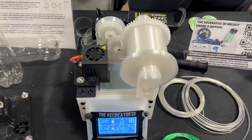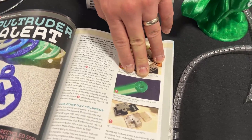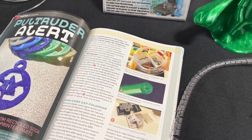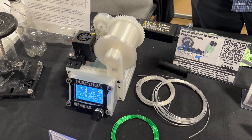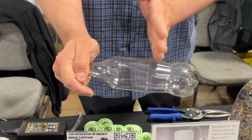Pulling at 1.65 millimeters is really easy to compensate for in your flow rate. When you're making it, you're taking that ribbon and turning it into a tube, so you're already dealing with a hollow point in the middle and you have to bump your extrusion rate up. I print it at 150% flow rate and it prints perfectly. This is our starting solution to get people into recycling plastic bottles and reusing material.